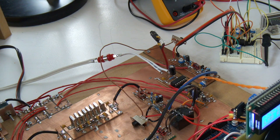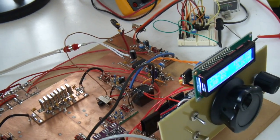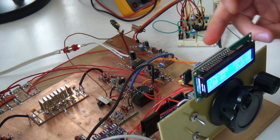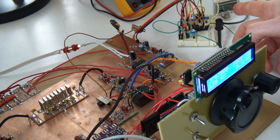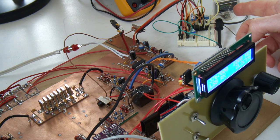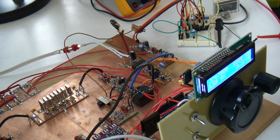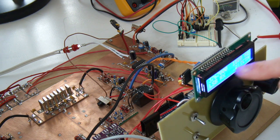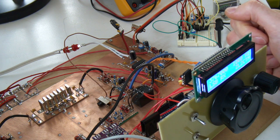As you can see with an analog meter, there was some thought about actually using the analog to digital converter on the Arduino to digitize that. Potentially I could even look to digitize that voltage there, or at least scale it between 0 and 5 volts and then have the ADC look at that and have a digital readout. So I may look into that. We'll see.